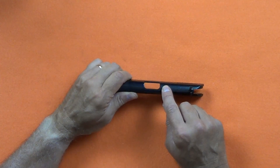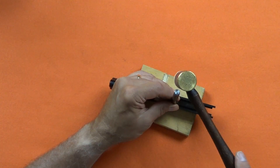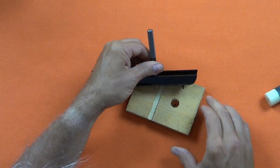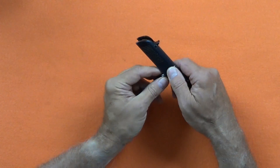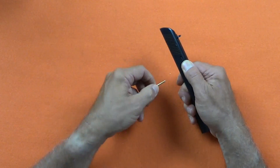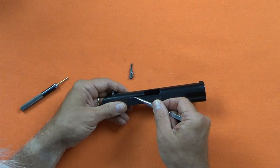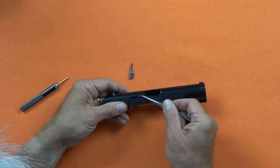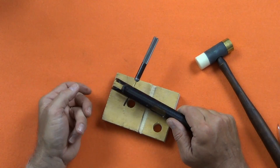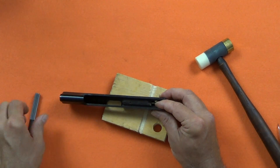The slide has two pins — one for the extractor and one for the firing pin. Remove the extractor pin from the bottom, keeping a little pressure on the extractor. The extractor removes easily. In a pocket under the extractor is a very small extractor spring. Remove the firing pin retaining pin from left to right — this is critical because it is a tapered pin. Keep a little pressure on the firing pin when removing the punch to control the spring.